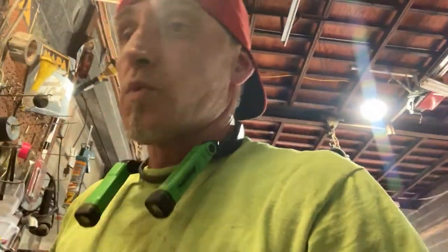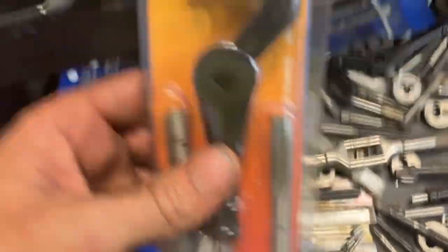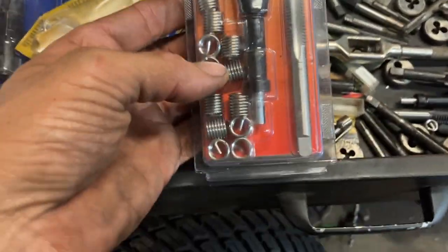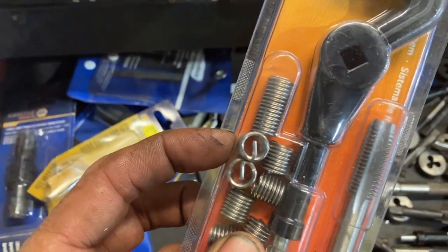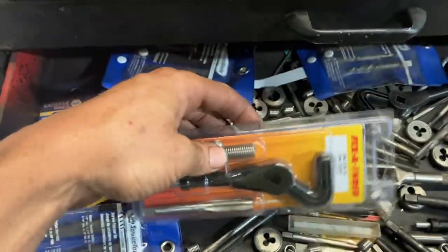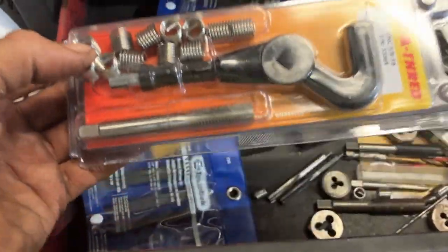Make sure there's some oil or lubricant in there. If that doesn't work, or you end up breaking a tap inside the block, your last resort is going to be a helicoil kit — I got this one at NAPA. What these little coils do is go inside the existing hole; the coil already has a new thread on the inside, so your bolt goes right down the center and it creates a new thread. That's a totally separate video — search my channel for 'helicoil'. But that will be your last resort if the tap and die option doesn't work. And that's it — that's how you use a tap and die kit in a nutshell.